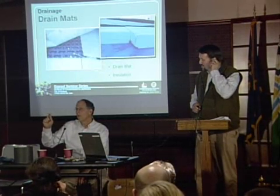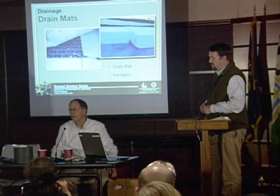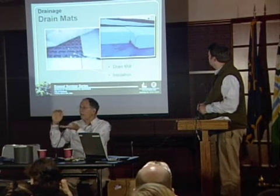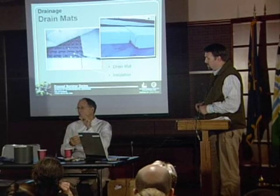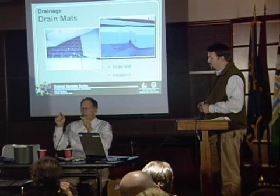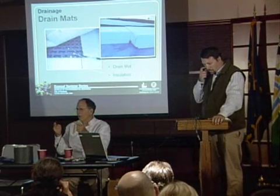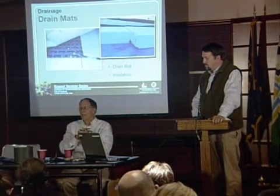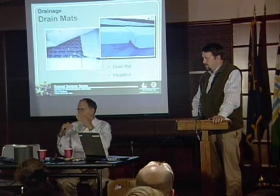Currently, the work going on in our region is that Portland State University has set up wind tunnels or chambers. It looks like a pizza oven. They are testing different eco-roof sections and plants for stormwater management, and they're trying to come up with an R value. I talked to the professor the other day, and he said there's nothing conclusive. They're getting R value readings of from 2 to 8 for soils from 4 to 6 inches, and there isn't necessarily a correlation between thicker and more R. Sometimes it's like random. The answers just don't comport with what we think we know about energy. So even at the best reading of 8, I assume for the 6-inch soil, it's not going to be a dramatic R value.